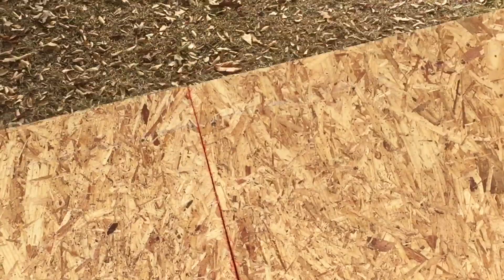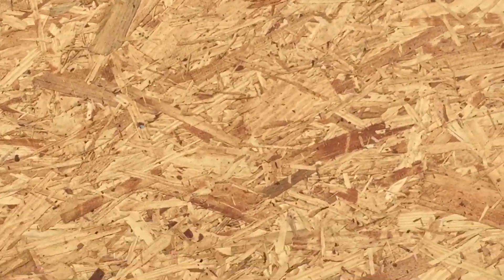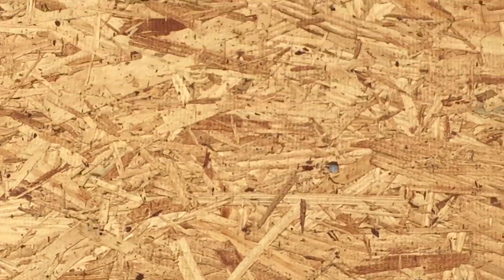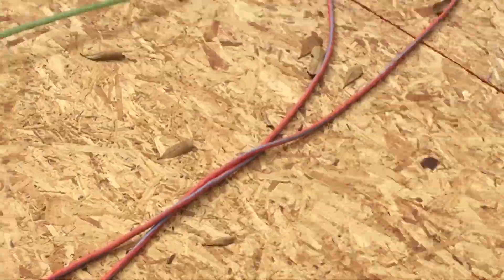Because when your roof gets wet — of course it's going to get wet, because it's your roof, it covers you from the rain — wood, when it gets wet, tends to expand. Or in different temperatures it will also expand and contract. And when it does so, if you don't nail it down properly or put the correct spacers in between your plywood, then of course you're going to have a deck that's going to start buckling on you. You're going to have to end up taking it off eventually, and it's going to look like garbage.